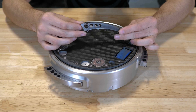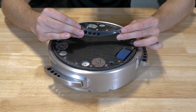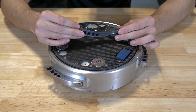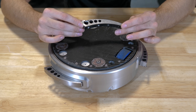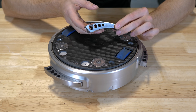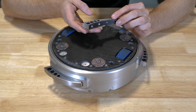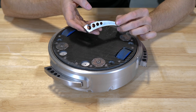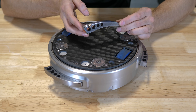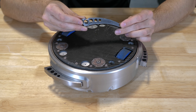One of these weapons is no longer attached. A nasty bot called Dropkick managed to shear four M5 bolts straight through the aluminum. The aluminum held up pretty good, but the bolts themselves sheared, so I definitely need some heavier hardware. The weapon is also quite deformed — it really got smushed. I think the hardening process went okay, but I over-annealed them, so they went back to a softer state. They probably would have snapped if fully hard, but might have done more damage to the other bot.